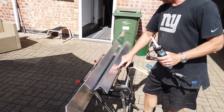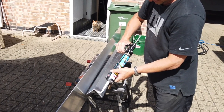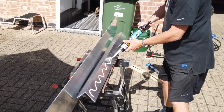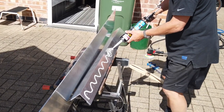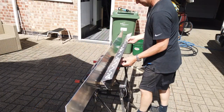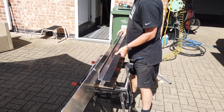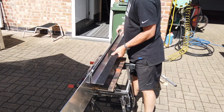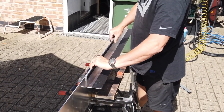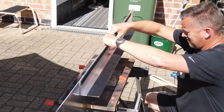What I'm going to do is go for a bit of No Nails, bang a screw through - hopefully that should hold everything in place. This is completely over the top, but I've got a tube of it in the garage so I thought I'd use it. It's going to stiffen it up if nothing else. That 3mm plate will just stick to that beautifully. Hopefully I've not put too much on - it'll all ooze out when I put the bolts through. This is the Unibond stuff, it's all-weather and it really does grip well.